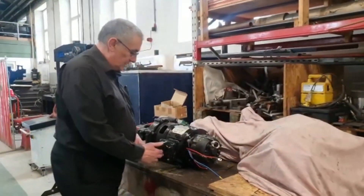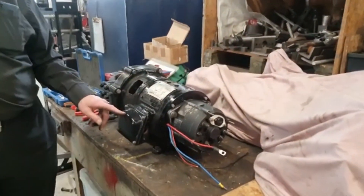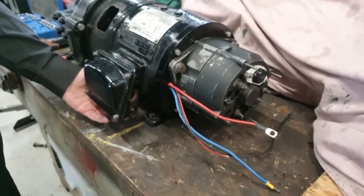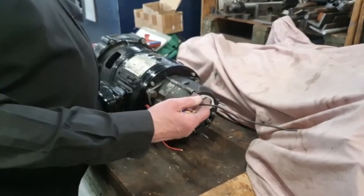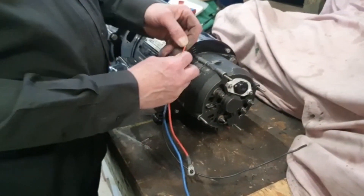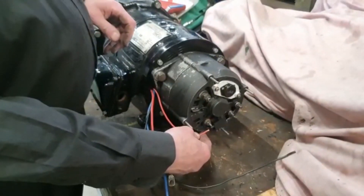What we are actually doing at the moment is reconnecting the electrical cabling to the back of the alternator, which goes into this junction box here, and the connection to the rest of the locomotive takes place through a gland underneath the bottom of the junction box. We have done a little bit of modification to the wiring, so I am in the process of fitting new ring terminals to enable us to get the wiring to the right length.